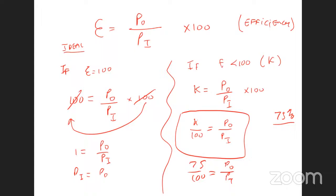All right, so that's it for transformers. The next thing we have to revise on transformers is the problems with the transformer and how they fix it. Anybody remember how they fix it? The transformer heats too much. It overheats. So what they do is take the transformer and cool it in an oil bath. And instead of one big slab for the soft iron core, they use sheets. The big slab is made up of different sheets, and each sheet is laminated. And they use copper windings instead of normal wire. All right, so you can read up on that from your notes.